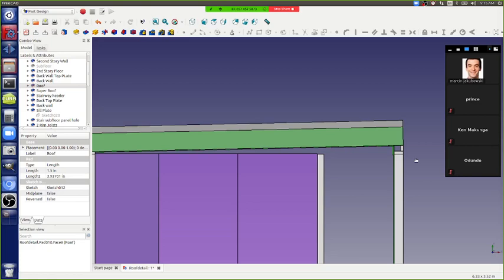But the things that are actually tying that roof down right now would be the hurricane straps, the metal pieces that are attached to every roof joist, and the sheathing on the sides. The sheathing on the sides is going to be perhaps the most significant, because it's continuous around the whole structure. Hurricane ties are only strips every 2 feet, but they're steel, so they're like 100 times stronger than the wood, so the steel does a lot.